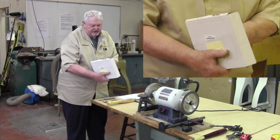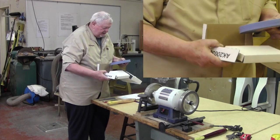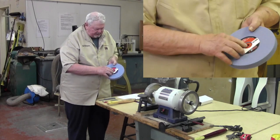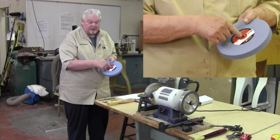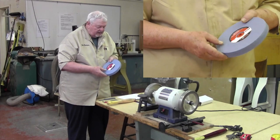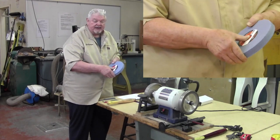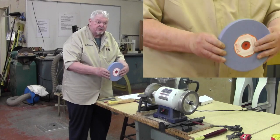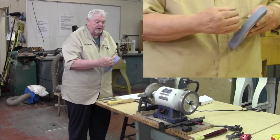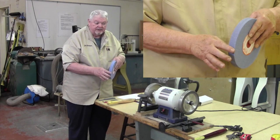This is one I bought — CGW, which is a Norton industrial brand. Inside are those same plastic inserts; one of them will fit the shaft of your motor. The first one is half-inch, the next one is three-quarters, which fits most standard motors. It looks perfect; however, once you mount it on your grinder, these plastic pieces will deform to some extent, causing just a little eccentricity as you tighten it down. So the very first thing you do is get out your truing stone and make this thing run smooth to your grinder.